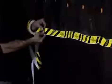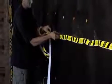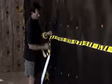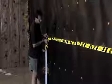Remember, any hole is cumulative, and if you have 10 to 12% of an opening on a 20-foot span of a wall, this will compromise your STC greatly. So take the time to seal every penetration to the best of your ability. Remember, if this room was a bowl full of water and you had a hole, the water would find its way out. The same thing applies with the sound. So please, double check, triple check, and inspect the installation before the drywall goes up.